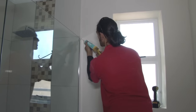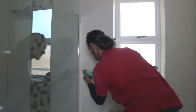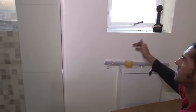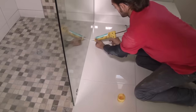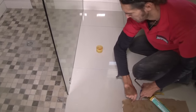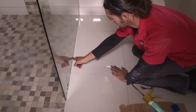The final step is to apply silicone around the shower. Silicone should be applied to the outside of the shower only — if it's applied to the inside and outside, water can leak into the joint and become trapped, creating a perfect place for mold to grow, which may cause unpleasant smells and look unsightly. When you apply silicone to a section, wet your finger with water and smooth off the silicone. Because your finger has water on it, the silicone won't stick and you can wipe excess off quite easily. Now use a forming tool to shape the silicone and press it into the joint, then run over the joint again with a wet finger to smooth everything off.